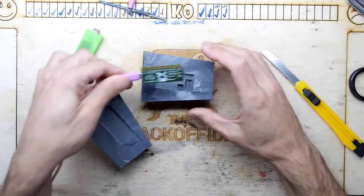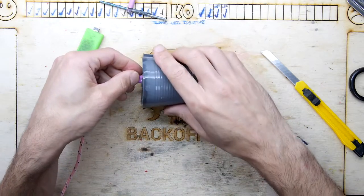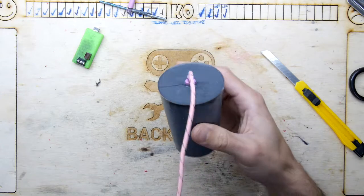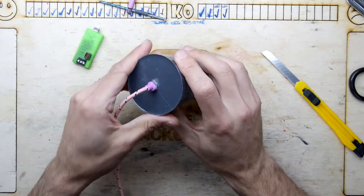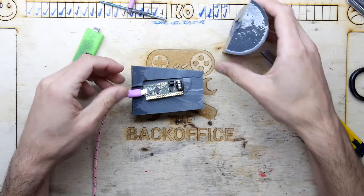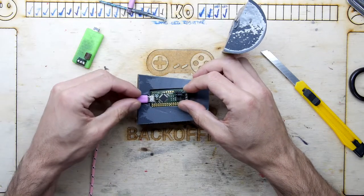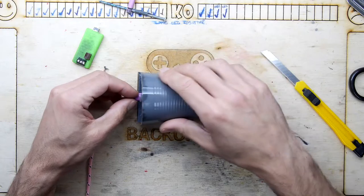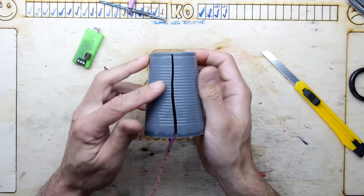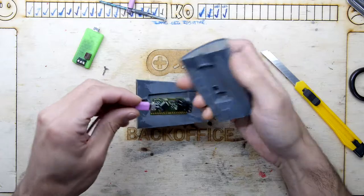You can see the USB is correctly oriented, so the PCB will sit in like that, then you put the mold on and fill it with resin. You might be asking how I'm going to fill it — I don't have a hole yet. I should have put a straw or something in here to act as a filling hole, but I think I can add something retrospectively.